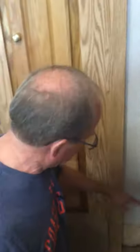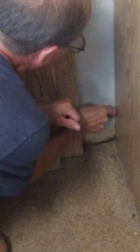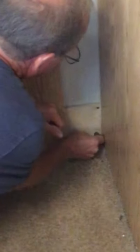Now we're back in the bedroom to fix the wood. I'm going to take some sandpaper, sand it down and clean it up, then mask off the area, protect the carpeting, stain it, and spray clear coat over it. I'll start with the same 100 grit paper I used before. Sand with the grain — the grain goes sideways here so that's the direction to sand. There's a screw there so I have to be careful not to cut my paper with it — it's a tight area but it can be done.